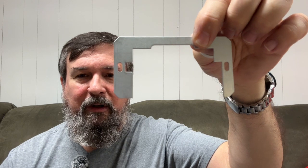So these will support the outlet so it doesn't fall back too far, and then the wall plate. I know some of you have seen it before. Older houses, you'll see where the outlet has a gap on the wall plate, or the wall plate looks like it's kind of collapsed in. That's because the box that the outlet or switch is in is too far back behind the wall, and something like this will help to alleviate that problem.